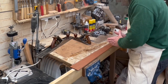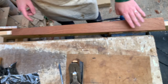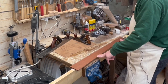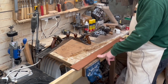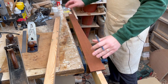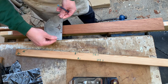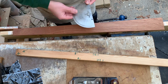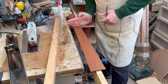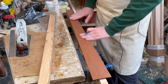Now we're at the stage where we can think about scale lengths, because this board is way too long and will get cut off. For normal fretboards, you mark off your scale down the center line and run lines at 90 degrees — and you need something accurate to make sure you're getting that complete 90 degrees. With a multi-scale, I actually think it's easier.